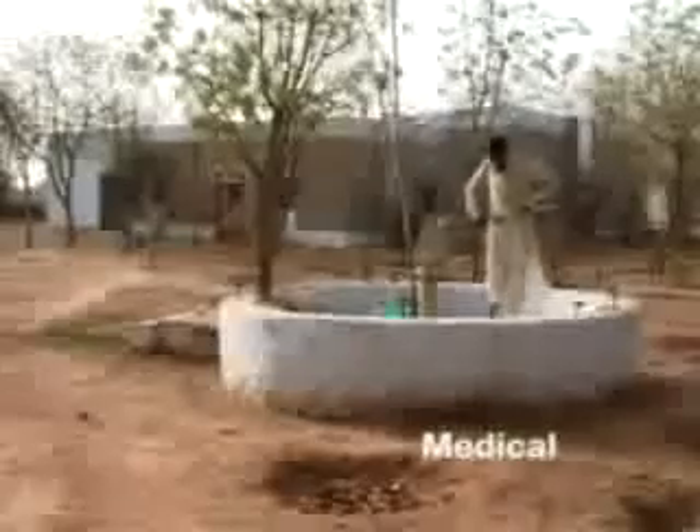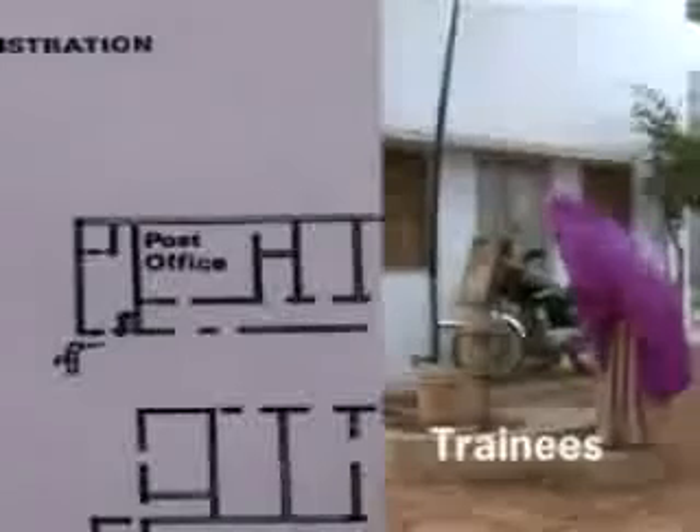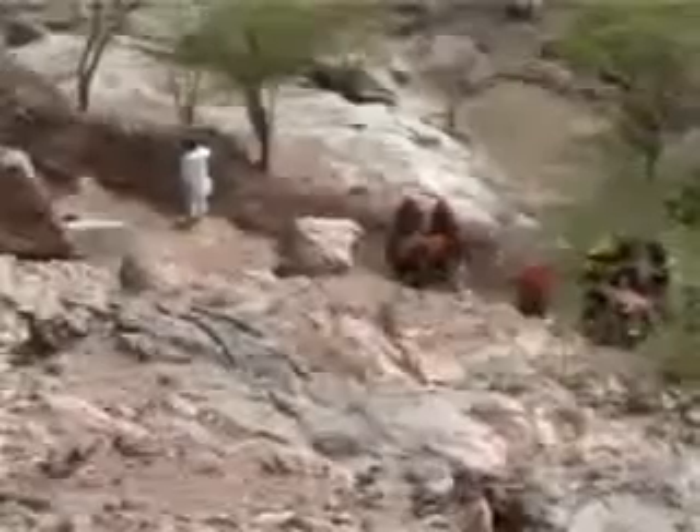Five India Mark II hand pumps were installed in the 80s to supply emergency drinking water to the common kitchen and to over a hundred staff, families and trainees every day. Three water tanks, each with a capacity of 100,000 litres, were constructed with ferro-cement by women barefoot architects to store all surplus water for drip irrigation, cleaning utensils, hand-flush toilets, as well as watering the plants and trees within the campus.